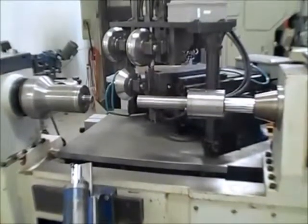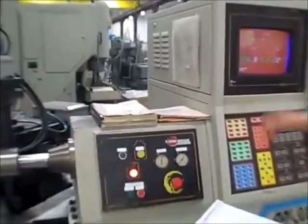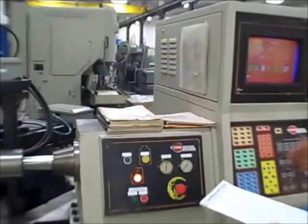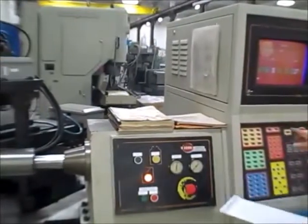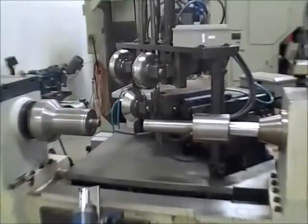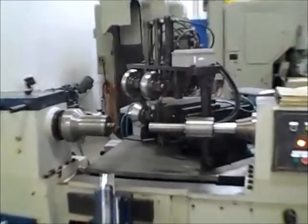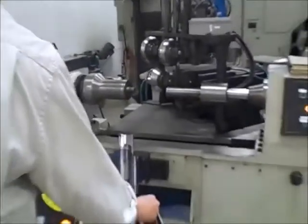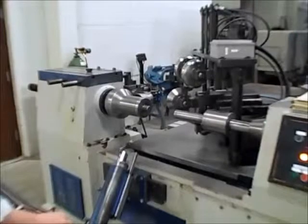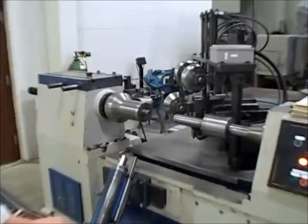I guess we can do a playback right now. Let's do a playback, then we'll do an auto cycle and load a program. So right now, to do a playback in manual — just to see how this works — I'm going to press PB. When I do this, kind of watch over here, I'm going to press push button which starts my recording, then I'm going to come right here and start recording the movement. We'll come back and stop it. I'm recording now, and everything I do right now should be recording. The speed control is off this joystick too, so I can go fast or slow. This is all kind of goofy, but just to get an idea of what it can do.